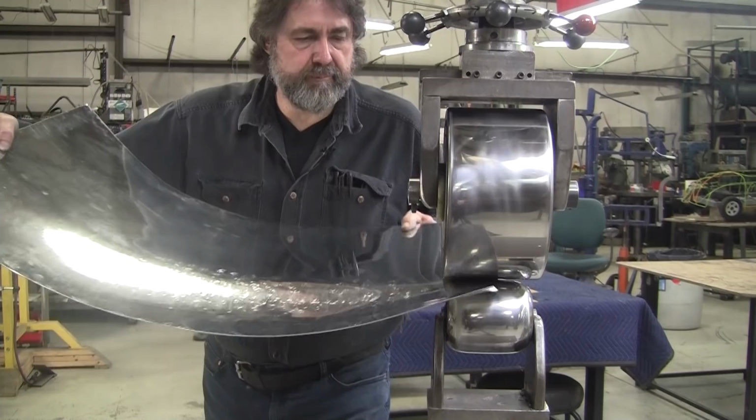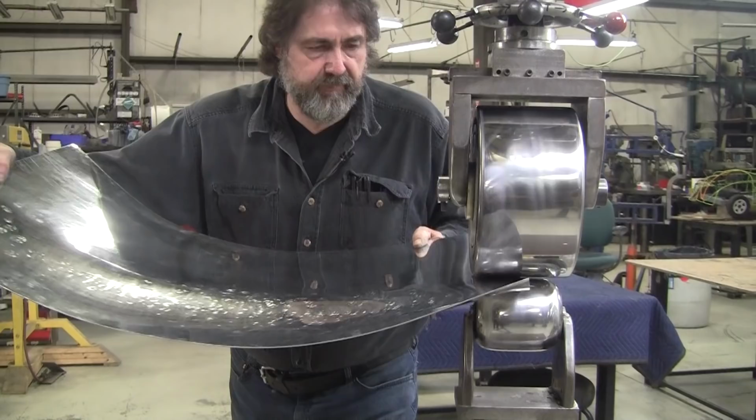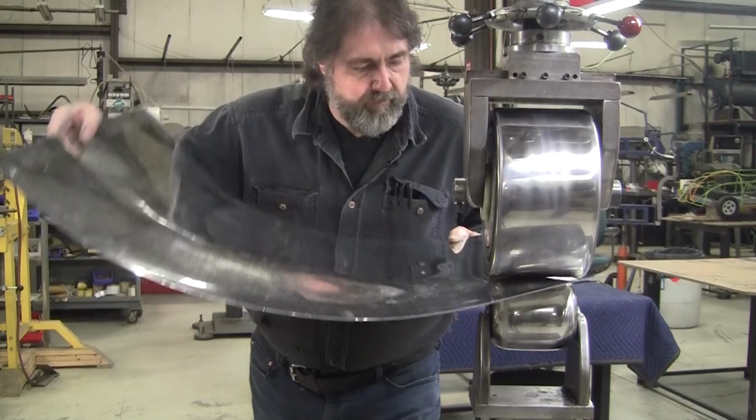And now I'm going to move inboard a little bit. So I do a bunch of stretches on the edge. This is a linear stretch, essentially. I do a bunch of stretches on the edge, and then I come inboard a little bit. Not as much as what I did on the edge. Otherwise, it just makes the panel worse. So that came up quite a bit there. I'm going to come in a little bit more here. And let's see what we got now.